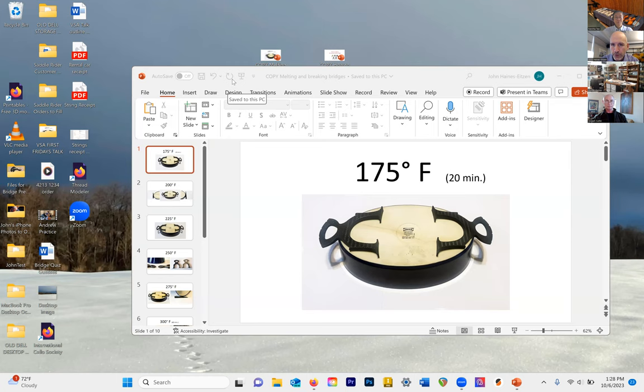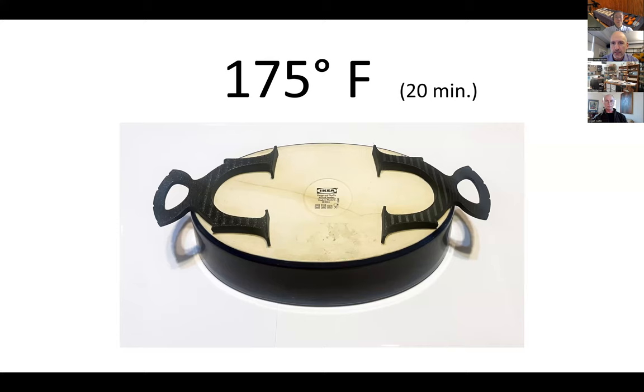Okay, so I've got two bridges here in an oven. I was doing it in 20-minute increments. Later on, I got into a phone conversation and cranked it way up. So this is a regular Prusament PLA. It's a very high grade, but it's just a base PLA filament. The appearance with the sparkles is just a cosmetic thing. They ran out of the black. This is a carbon fiber and PLA composite. It's about 10% carbon fiber material. The rest is the PLA. The print settings are pretty similar.